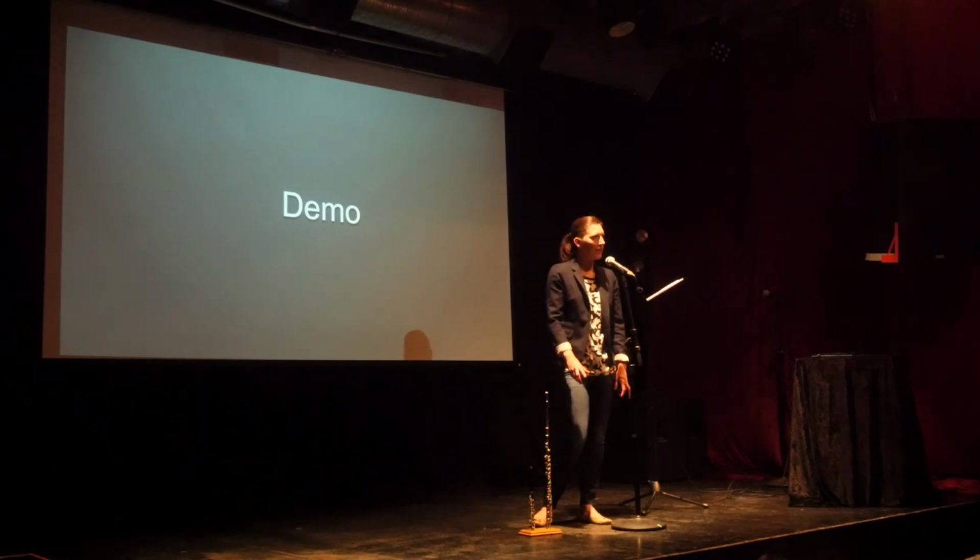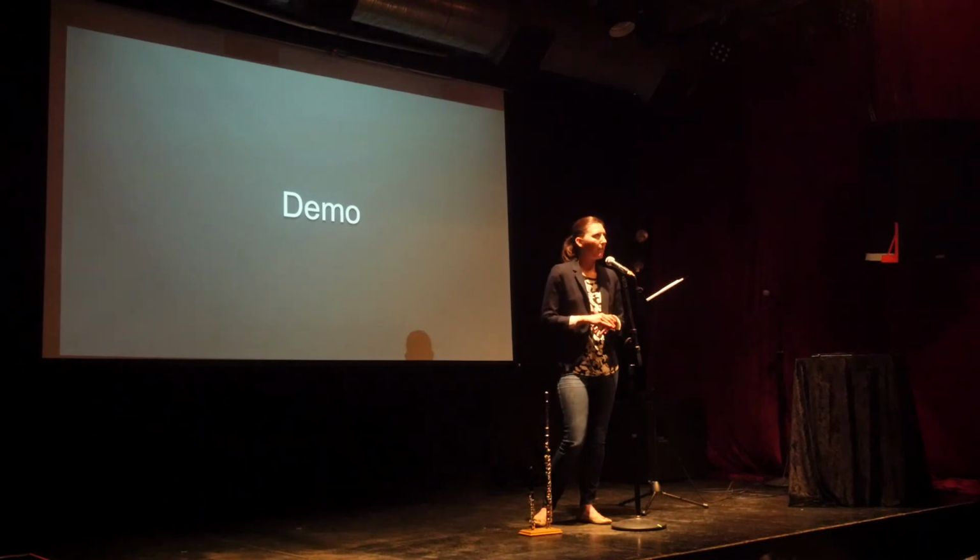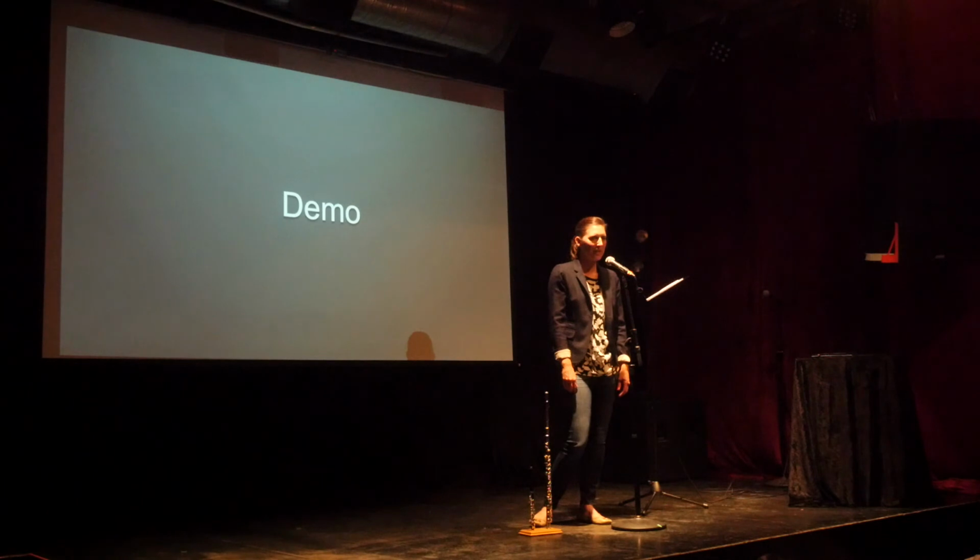By that time, I had already played for years and years, so it was pretty fast for me because I knew the mechanism of the instrument very well. I just had to learn the actual technique of how you file and how you solder, that type of thing. So it happened fairly fast. And there was another part of the question. Oh, yes, I did mess up sometimes. It's really kind of disheartening when you mess up with 14-karat rose gold and you have to melt it down and send it back to the factory to smelt and then put back in a lip plate or a tube again. So that happened a couple of times.